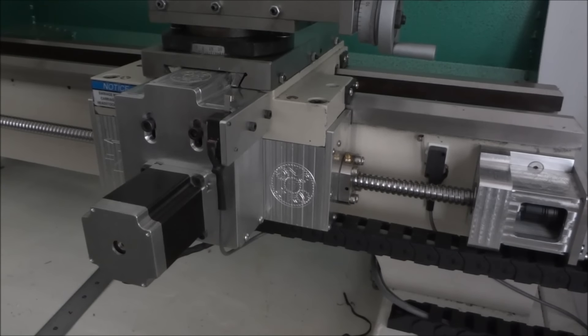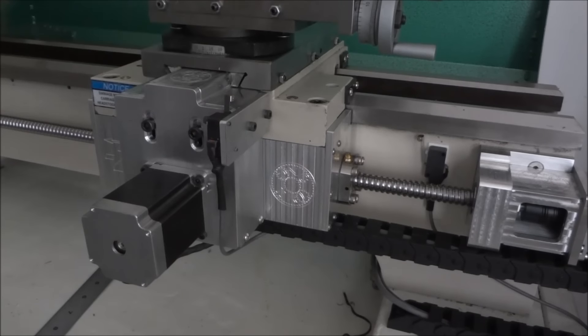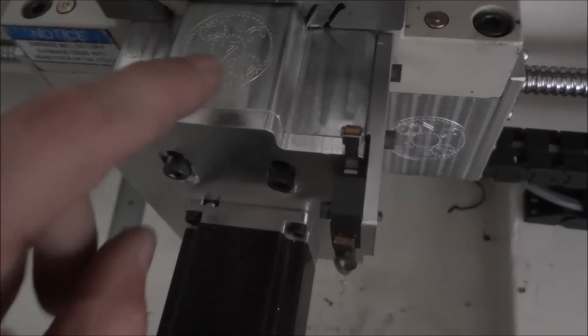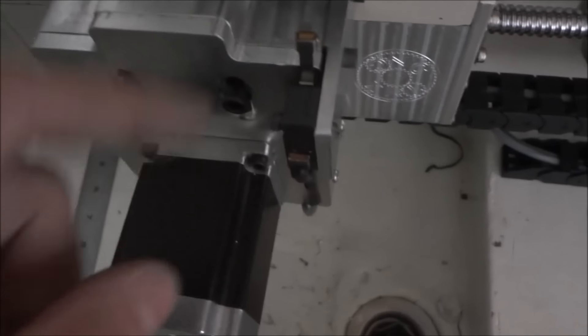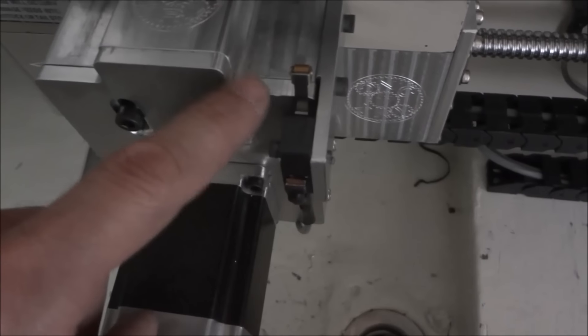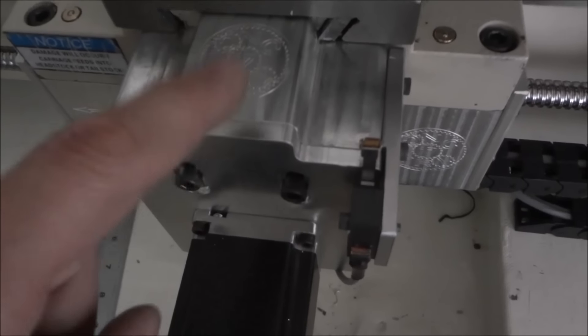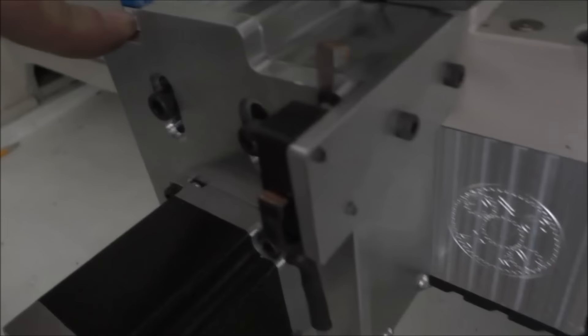You can see that we have our home switches connected and wired in. I had to make this little bracket — it's just some quarter-inch bar that I made for the X-axis. I had to relieve it here just a little bit so that the plate for the belt adjustment can go up and down and clear it. There's a little play right here so it's not rubbing, and the plate's probably not going to come up anymore — it'll only go down if the belt stretches. It's secure.